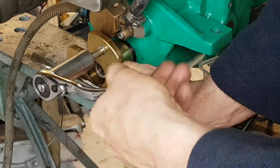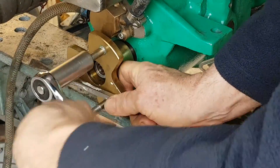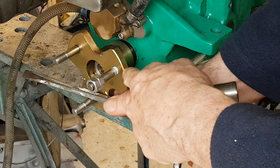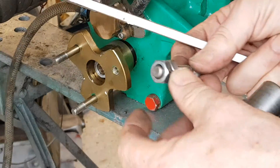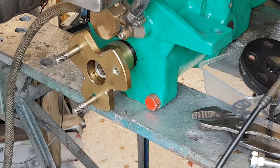Here it comes — this is a brass flange. You'll find the steel ones can be more difficult, and if you've got a steel one that's corroded in, you could use a blowtorch to heat up this rim and it will make it easier, or you could take the flange off and put it in a vice.